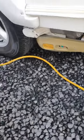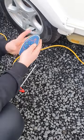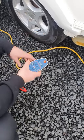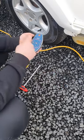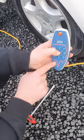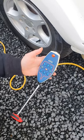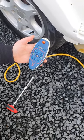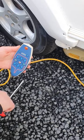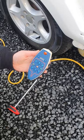Once you've got it locked on, go and take your handbrake off. You can then move the van — this is the front of the van — so you can move it forward, reverse, and left and right. Once you've got the van where you want it, pop your handbrake on. To disengage the motor mover, press and hold the middle button again, then press the button facing towards the rear of the van and release. The lights will count down and it'll begin to disengage. When using the motor mover, the lights along the top are your speed — towards the right is faster, towards the left is slower.